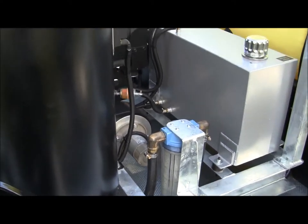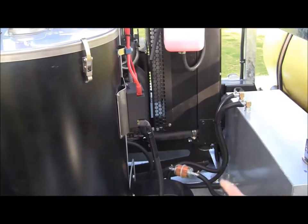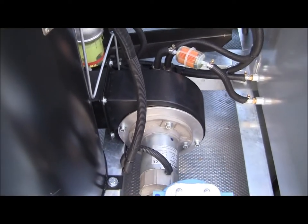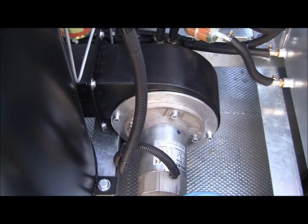One of the last requirements from this customer to be mine-compliant — this has had to be fitted with a 12-volt transformer and 12-volt blower motor. This is again unique to what we class as a mine-spec unit. We also have the 240-volt option from Jetwave.